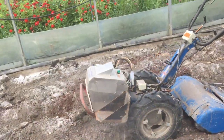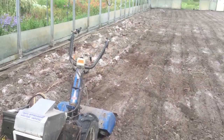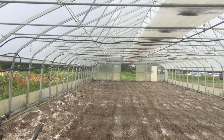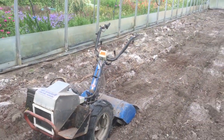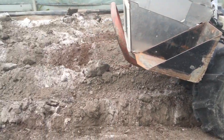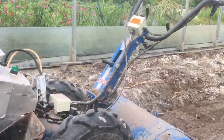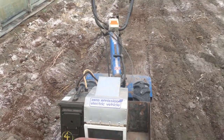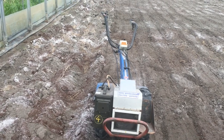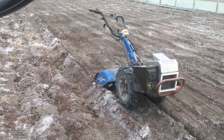This is a second battery pack, and it looks like it's going to take two batteries to do this entire greenhouse. So two kilowatt hours — this greenhouse is 35 feet wide and 150 feet long, and we're tilling probably four to six inches deep. Pretty aggressive. The ground is dry and in some places compacted, so it's a pretty good stress test for the electric BCS. I just checked a minute ago and the motor is not getting hot. Been running it steady for about 30 to 45 minutes and it's doing fine, so it's very promising.